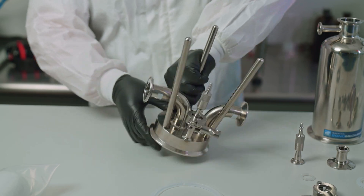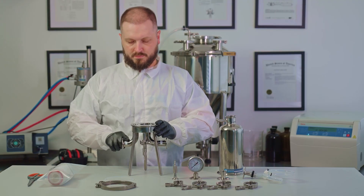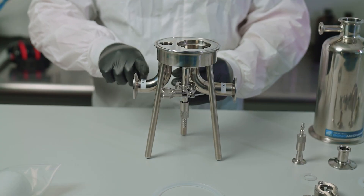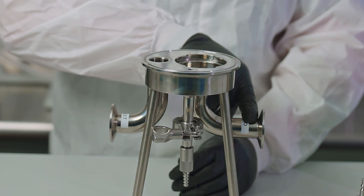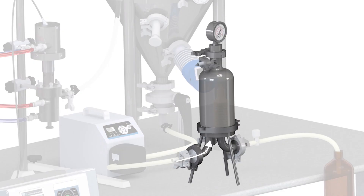Flip the base over and keep in mind the position of the inlet and outlet. Note how the small hole on the top of the base corresponds to the inlet and the large hole where the cartridge will fit corresponds to the outlet. When filtering, the nanoemulsion will enter through the inlet in the housing base, fill up the volume between the housing body and the cartridge, pass through the membrane to the inside of the cartridge, and exit via the outlet in the housing base.